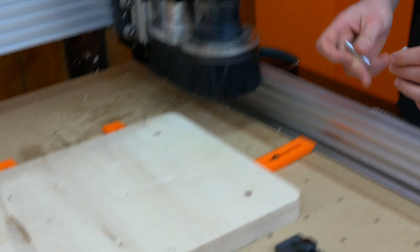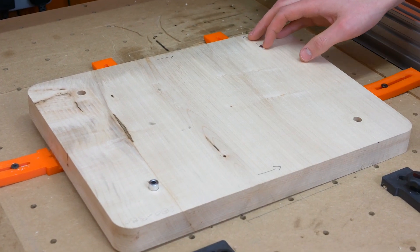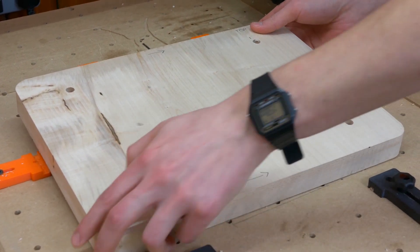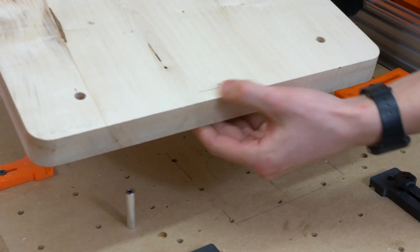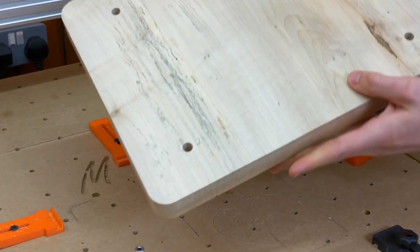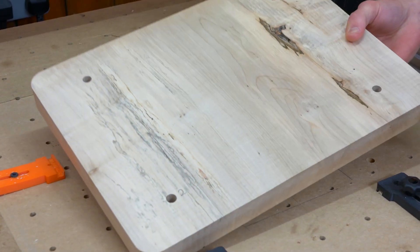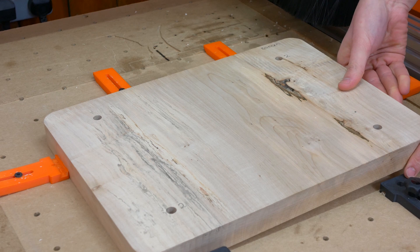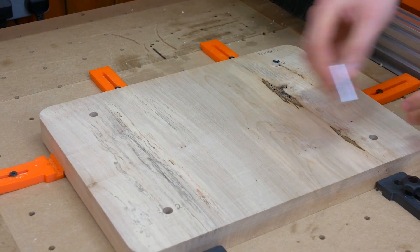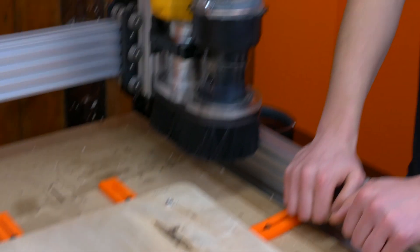With our pocket toolpath complete, we can begin to look at how our jig works. We're going to use these aluminium spacers as references using the holes in our spoiler board. If I just flip this over, using the direction that I've marked out on my software — the same goes for the material — we're going to flip it in this direction, using the holes on our spoiler board, in the second slot holes which have been mirrored in the program, to place the material down and reference those holes, exactly the same position as it was on the other side. Now we can get ready to run our roughing toolpath.